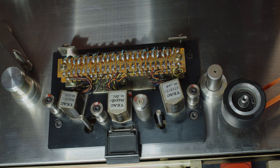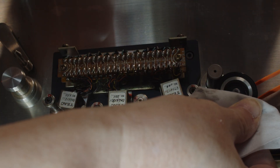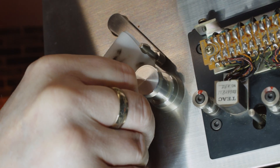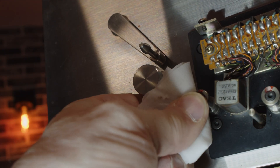Sticky shed tape left residue all over the rollers and guides, so I'm working through each one with alcohol and elbow grease. The pinch roller is shot — divots and all — so we'll replace it later. But for now, I'm cleaning everything the tape comes in contact with. When the new roller arrives, we calibrate. Even the exit guide alignment matters here; if it's even slightly off, the tape hits the heads at an angle. Every fixture the tape touches needs to be spotless and true. Somebody probably wanted to play that back and ingest it, dub it into a digital workstation, and the tapes are going to give you one pass and then be totally destroyed.